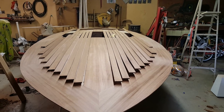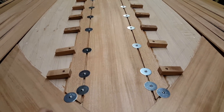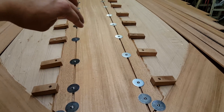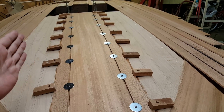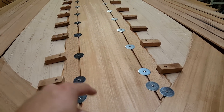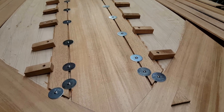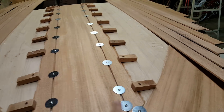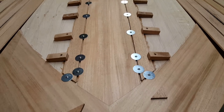Here are the very first two two-inch planks. I made little quarter-inch spacers and stuck one at each end, one on the inside, and one in the middle. Applied all my epoxy, slid the plank up tight, then slid it all the way down until it butted into the adjacent one — that sets my gap all the way around. I'm using half-inch screws with fender washers; the half-inch screws would just about poke out of the bottom, but with the fender washer they don't. I'll use the fender washers between seams so there are no screw holes in the boat. Two planks down, a whole lot more to go.